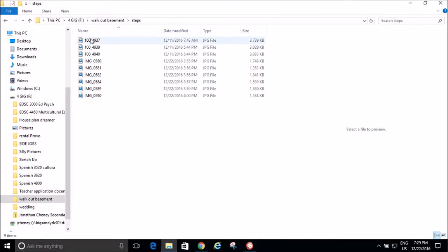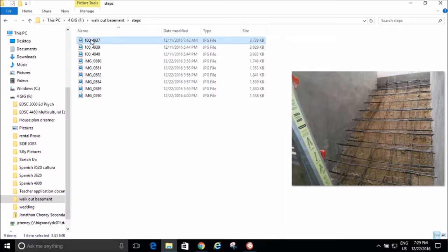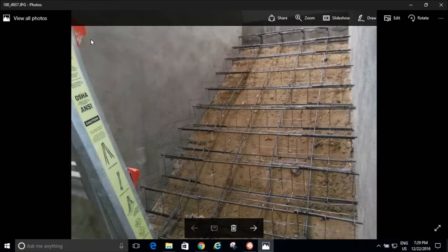Now look, you see I got my walls stuccoed. They came out pretty rough. I'm going to tell you, they came out rough. Here's why. As I was stuccoing my walls, the temperature started falling. And I did this at night after school. So I barely got my stucco on, and I had to start floating it out immediately because I was running out of daylight, and I was afraid it was going to start freezing, so I had to go a lot quicker than I wanted to on this.